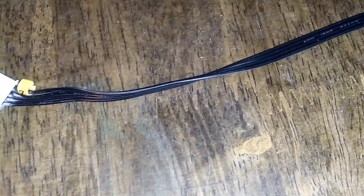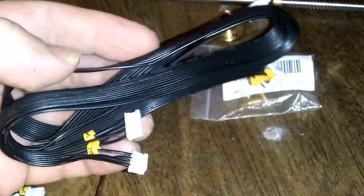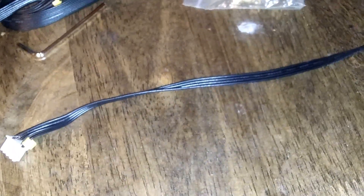In a last act of desperation — unless the board itself was the problem — I went and bought a replacement wiring harness on Amazon. I'll leave links to all these spare parts in the description. It's pretty cheap, about 12 bucks, and it comes with the Z cord and every cord you need for the Ender 3. I took that cord, plugged it into the connection, unplugged the old one, and plugged it into each one of the motors — and every single motor spun perfectly fine, no noise, nothing. It was the cord itself that was the problem.